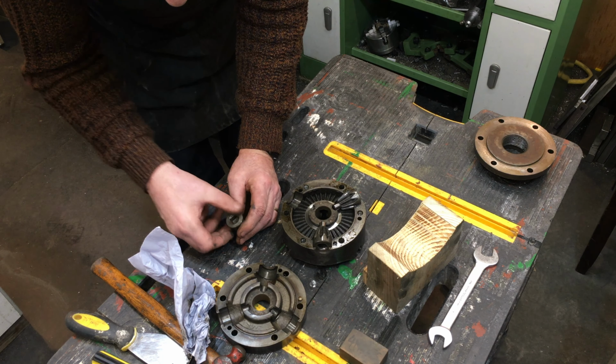Having exposed its gizzards, I turned my attention to its teeth, the scroll gear. The scroll plate in most chucks are radially geared on one side and scroll or spirally geared on the other, on a parallel plane to each other. Now, on this chuck, the scroll or spiral gear is cut into an inverted cone, and the jaw sliders also follow the same conical track.